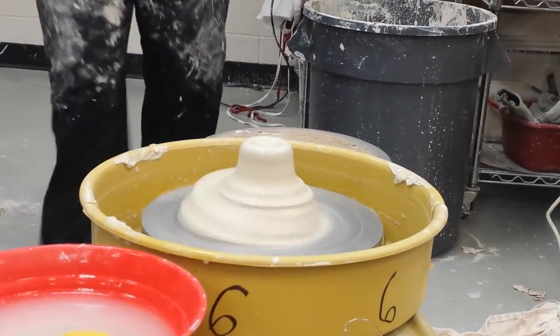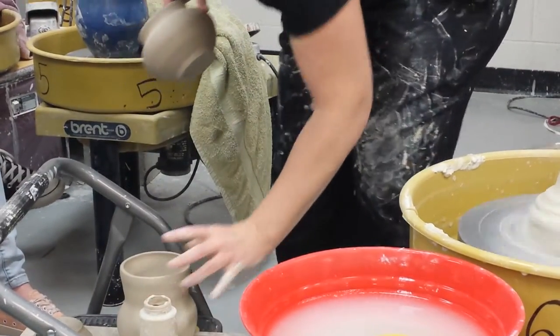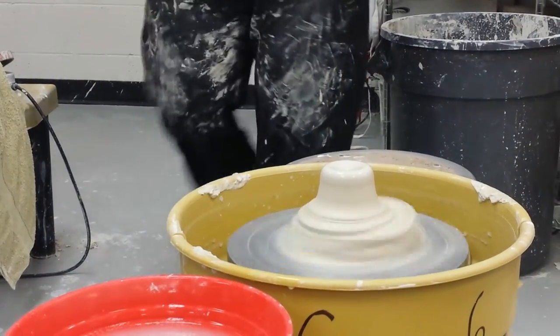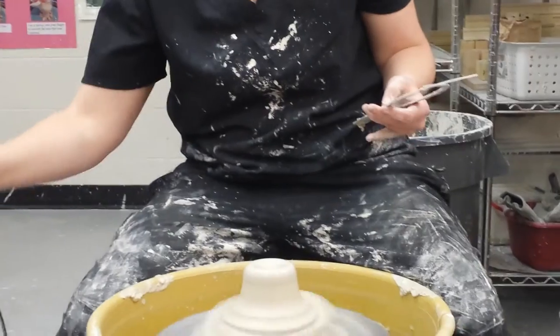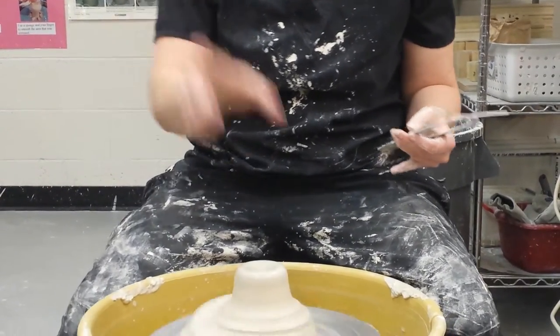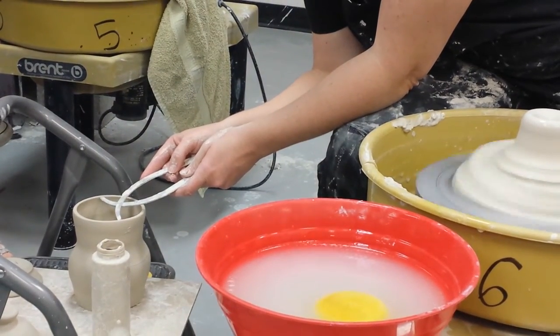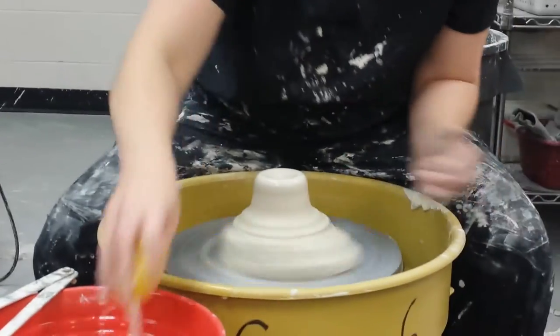Let's say this is my vessel I'm using to create for my lid. You need the calipers, and this time you're going to measure the inside of that container so that the outside of the flange fits the inside. So when I do this, I'm measuring just the inside right there, and that's my dimension I'm going to have outside of the flange.